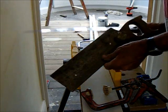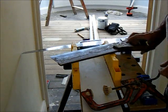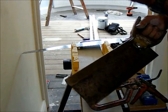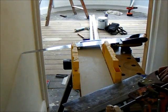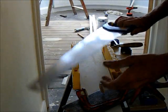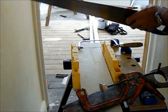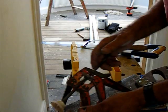So first things first - if we want to scribe we've got to cut a mitre on the end. You're going to want a back saw, or you can buy hard point saws that you don't have to sharpen. This one I sharpen myself, but I'm beginning to lean towards the hard points. It's not a very fine cut but it'll work. You can also buy fine cut versions. You'll need a coping saw as well.